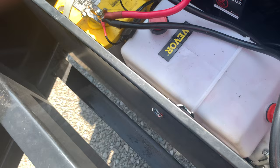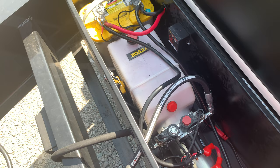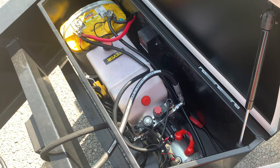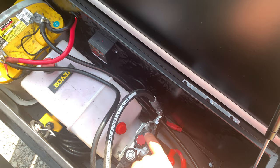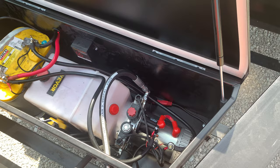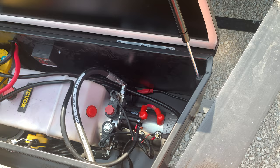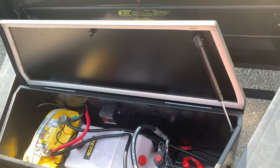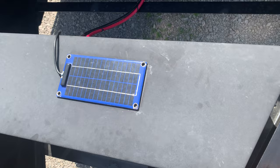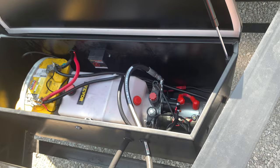I got the plastic reservoir here — I just wanted to see my fluid levels. They have a metal one that's probably a little bit more solid, but you can't look inside of it. I got this toolbox at Harbor Freight, this old cheapy, mounted it up here just with some nuts and bolts. Your pump only mounts with two bolts — they're pre-threaded into that motor. So all you gotta do is drill your two holes, find your bolt pitch and thread, and you're good to go. It's really that simple. The box keeps the water out actually surprisingly well. The top is faded already, but for the cheap price you pay, I'm good with that.